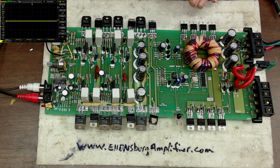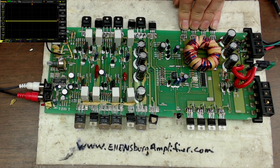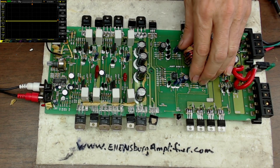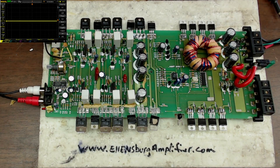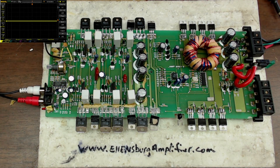I may adjust the preamp section to help match this board to today's head units. The primary problem of the board has been resolved — power supply stone cold, transformer cold, no components heating up, even resistors cold, output transistors cold. Overall the amplifier is great; I just need to do something with the input sensitivity or this board will come back with a burnt output or burnt power supply. Thank you for watching. If you like this kind of content, please like and subscribe, leave your comments below, and we'll catch you on the next one.